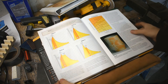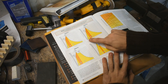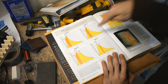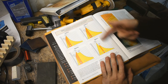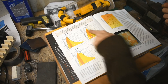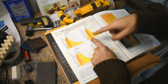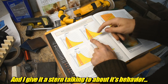The controller has another output you can program to do whatever — like you can have a fan turn on at a certain point to circulate air. I probably could make something so it turns on the gas at a certain point and turns it off at another point in the firing, but I'm going to do this manually. That's because anything involving gas and fire, you really need to be there standing and watching, making sure it doesn't cause a problem. This is pretty normal for firing a pottery kiln — you watch it the whole time. When I'm melting metal and doing metal casting, the whole time the furnace is heating up I'm standing less than 15 feet away watching it. If the burner goes out or the fire backs into the burner, I rush over and fix it right away. You don't want to leave this crap unattended.